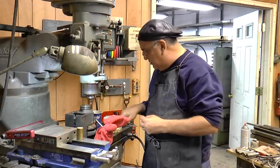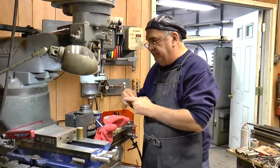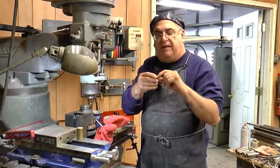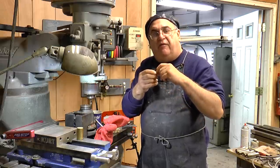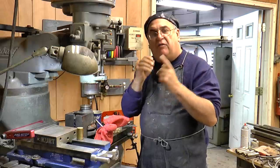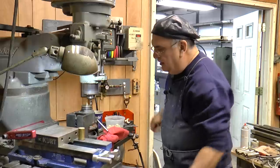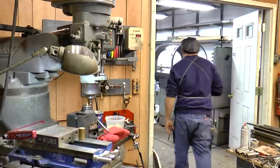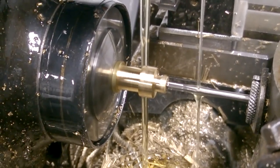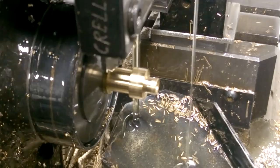Now this is a hardened super spacer. It's an old one, but it's a very good one. Takes 5C collets. And I got a stop set in the bottom so it doesn't set up against that lip there, because there's a little bit of a radius that could be variable, so I know that the length of these are right on each one. So put the thumb down, put that in there. Take a quick look over at the DSMA, make sure everything's running right. Yep, still running. Got 9 parts made already. This is the 10th one it's working on right now.